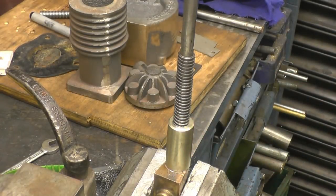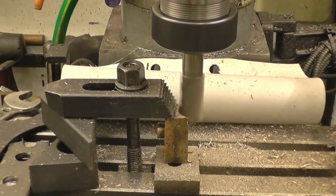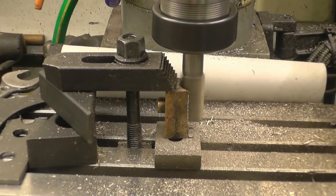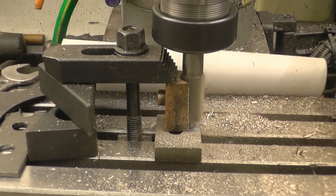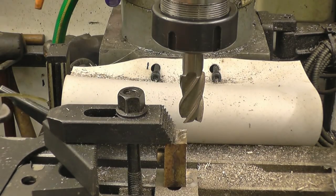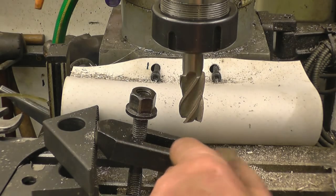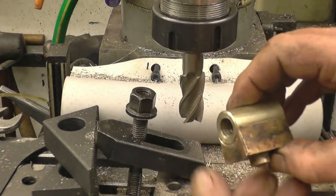This part here has actually, by the look of it, been handmade. There'll be shims going underneath there to line it up, so the height isn't that critical but I'm going to get it as near as I can. Right, that looks pretty good — that looks very good. It lies in there quite nicely. A little bit of work with the file and that'll solder in there, and it should do the job splendidly.